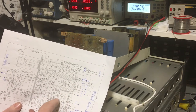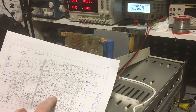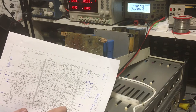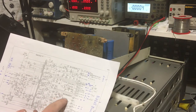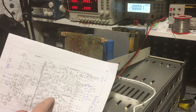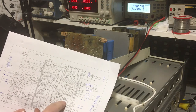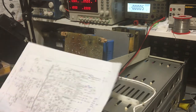This is a really simple circuit - there really isn't a lot to it. We've got CR11 and CR12 here. I don't recognize those symbols but there's only two legs on those parts - they are diodes. I need to measure TP6 and TP7 to see what's going on, and from there I can re-evaluate the circuit. If that supply is there, this should be turning on. It's pretty simple - just a pass regulator and voltage control. This one is turning on the positive, and this one is turning on the negative.